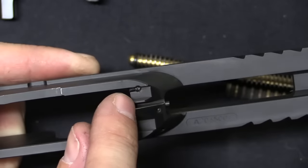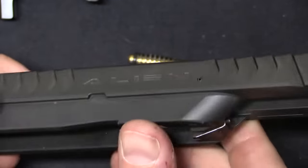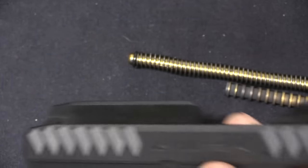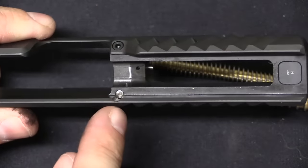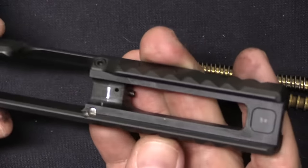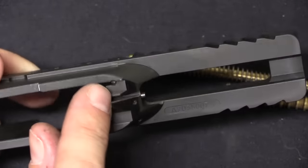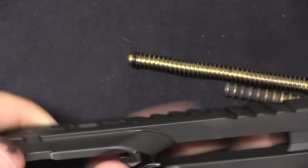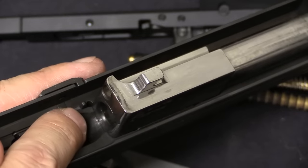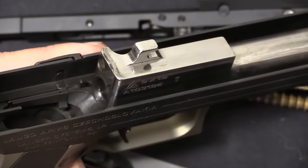There's a really clever safety that's just inherently built into this system. You always want a way to ensure that the pistol won't fire if the slide's not all the way in battery, because then the cartridge can rupture and the gun can explode. Normally you would have some sort of trigger disconnect so that the trigger can't be pulled if the slide's not in the right place — and that can be a fairly complicated system. Here, by nature of having this vertical transfer pin, if the slide's not fully in battery, that pin doesn't line up with either the sear or the trigger down below. No extra special steps required — that's very clever and very efficient.